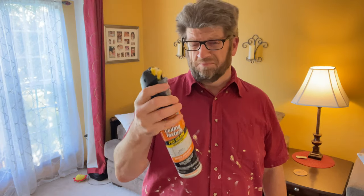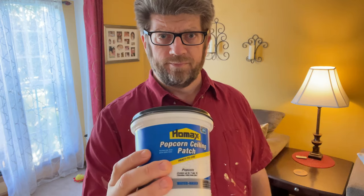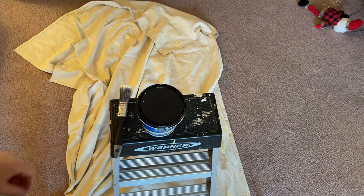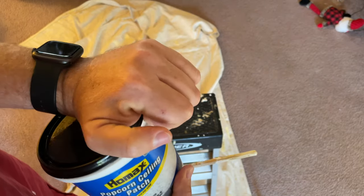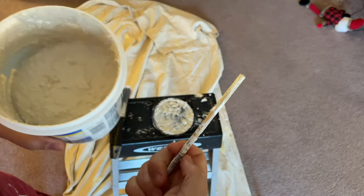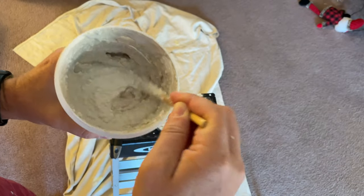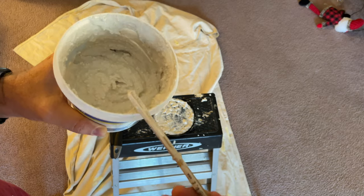Here I am in my painting shirt. I've tried the spray-on popcorn ceiling repair stuff, and it's messy — it shoots all over the place. Instead, I'm going to try this tub of popcorn ceiling repair. I'll put a link below. It's pretty straightforward — you can get it from Amazon. It's just a tub like spackling or joint compound. You open it up and it looks a little bit like cottage cheese. I stir mine up a little bit since it does settle in shipping. If it's too thick, you can add a little bit of water, but it pretty much comes right out of the bucket ready to go.